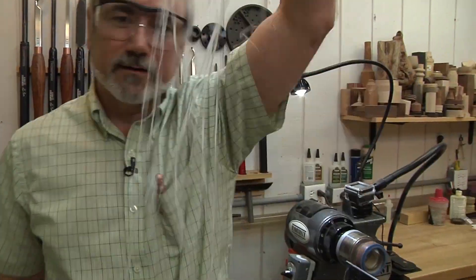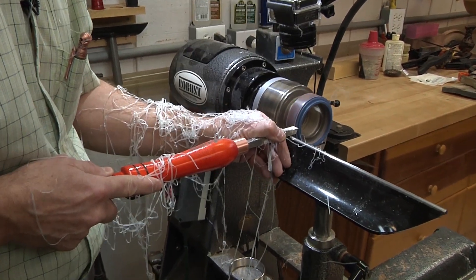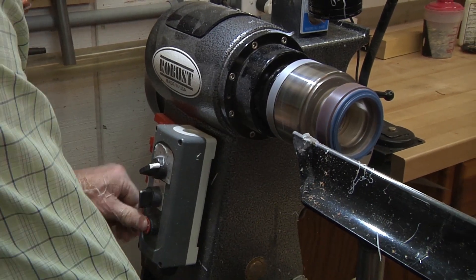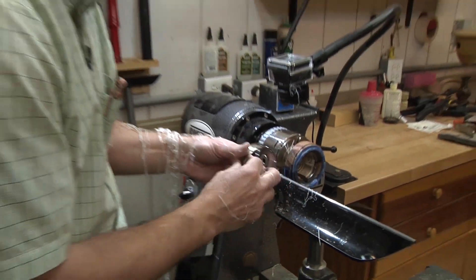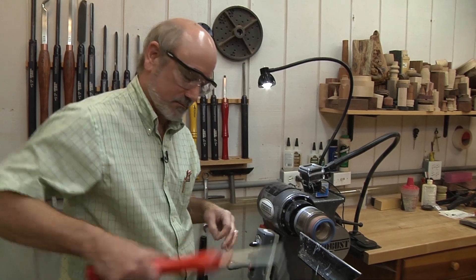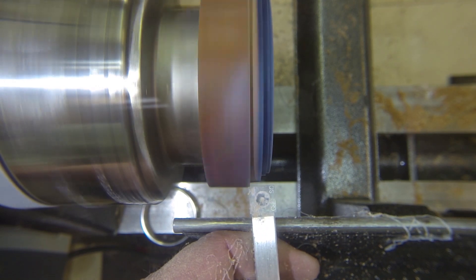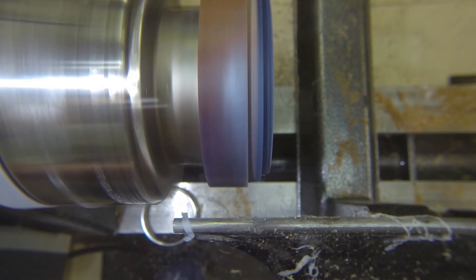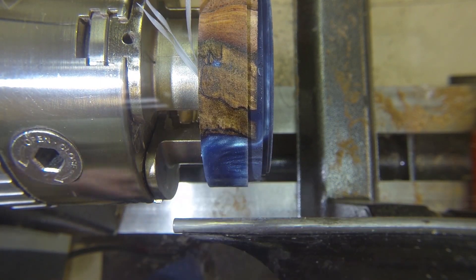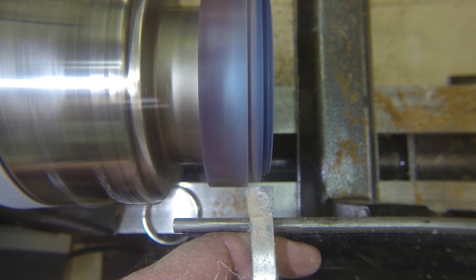I'm going to work my way up to the line. The cool thing is if I go a little too narrow right now, I don't have to worry because this wood's not going to be here when we finish the bangle - we only need a thin strip. If you're using a regular cutting tool and cutting into this plastic, if you rub your bevel too hard you'd actually start melting the plastic and it makes the cut a little bit harder to do. So I love coming in with carbide and just doing a clean slice.